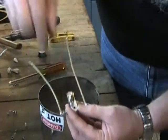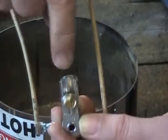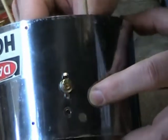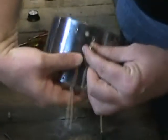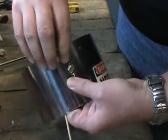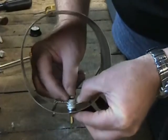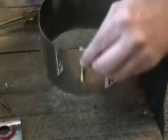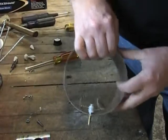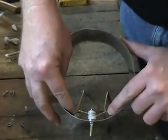Before attempting to mount the new thermostat on the casing ring, the stop tabs on the upper thermostat plate and on the adjusting shank should be positioned so that they are located opposite of each other to match the cutout on the casing ring. From inside the casing ring, place the thermostat shaft into this cutout keeping the casing and thermostat mounting holes aligned. Next, take the mounting bolt and going from the outside insert the bolt through the casing and thermostat assembly. Holding the bolt and thermostat in place, turn the casing ring for better access to apply the nut to the mounting bolt. With a pair of pliers hold the nut in place while you tighten the mounting bolt firmly with your Phillips head screwdriver. Now bend the tab slightly away from the casing's inner wall to prevent the possibility of arcing or electrical shorting between the thermostat and the casing ring.